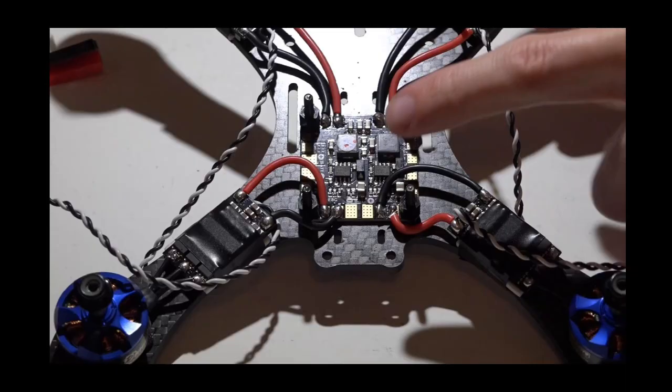How many of you noticed that my ESC number one power and ground wires were flip-flopped? I had power on ground and ground on power. At the end of the video when I told you to check for continuity on the XT60, I had already fixed those wires off-camera — that's why you didn't see my multimeter beeping. I didn't fry anything, and it's been a very very long time since I've fried anything.